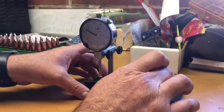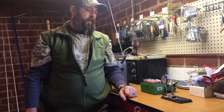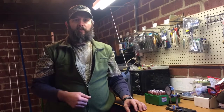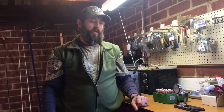You can buy these from Brownells — I'll put a link down in the description. These are standard with this dial for $119. I think I bought mine on sale for $89.99 from Brownells — that's a pretty good deal. I know there are some other manufacturers that make them. Hornady makes a great one where you can actually slightly adjust the concentricity — if the bullet runout is off a thousandth, you can push it just a little bit to straighten it, though you wouldn't want to overdo that. This is a great tool because a lot of times you can tell if you've got a problem with a die that is causing extreme runout. This right here will tell you real quick what the problem is so you can get it fixed.